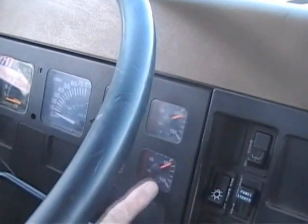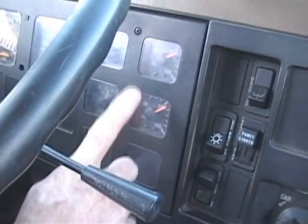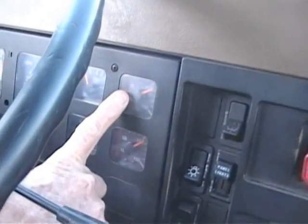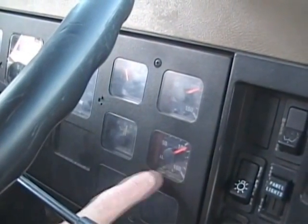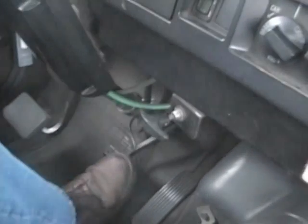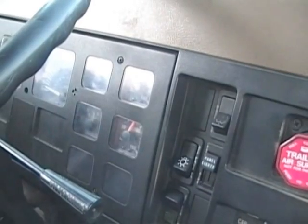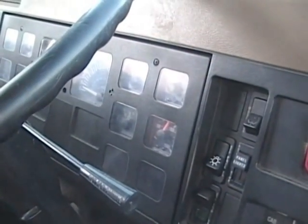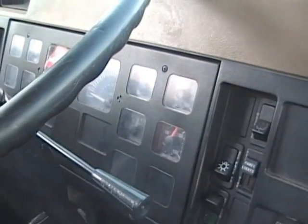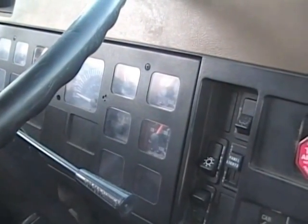Right now our primary gauge, which is the top one, secondary's on the bottom, are both well past 100. My primary's at 110, my secondary looks to be about 105. So I'm going to fan the brakes down to about 90. That way when I start the engine, we'll be sure the needles rise. So I'm going to start the engine, increase my RPMs. My governor has to cut out no higher than 130.